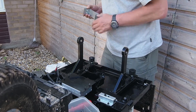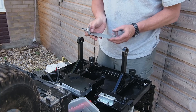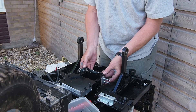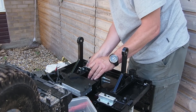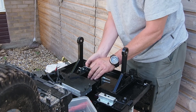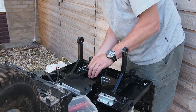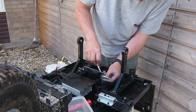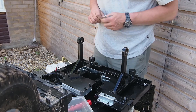Remember that we have four bolts holding on the original single motor assembly. What we do - and I find it best if you hold it like this - is slide the heads of the bolts past the plate like this, then use the same nuts and bolts, line them up and screw those four bolts in nice and tight. Here I'm just doing up the last of the four bolts, making sure the spring washers are in place. The back plate is on.